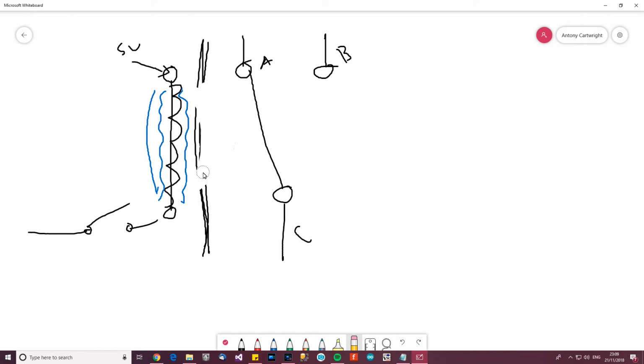So if I just delete this, we've got a voltage already, a bigger voltage, and now we've got its full potential voltage that the inductor could induce, if you like. Basically, the energy that was stored magnetically gets converted back into electrical energy and forced through the circuit. And now it can't go through the usual route here.